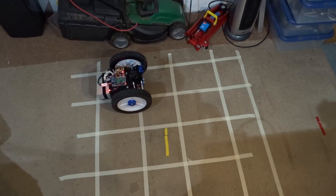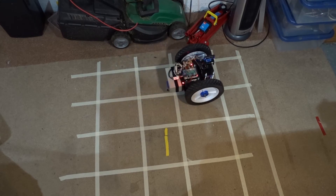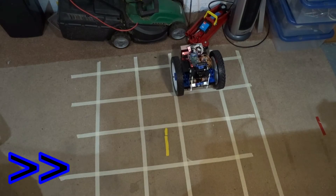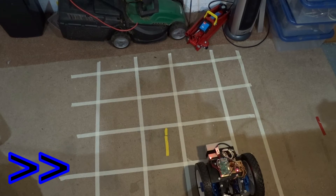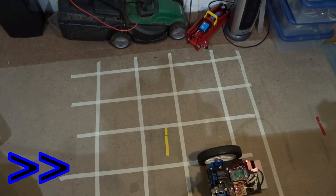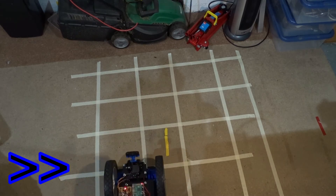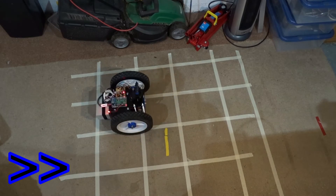After many hours of adjusting settings — including the turn PID parameters and how the Raspberry Pi checks that the robot has reached the required angle — I was checking once and now I'm checking multiple times to make sure the robot is at the correct angle. I've now got a reasonable square pattern being driven by the robot. I've also set up the data logging, so I'm collecting distance travelled, yaw angles, and servo positions as the robot moves around, and I'm capturing images as the camera scans.